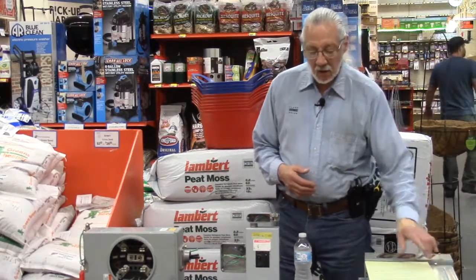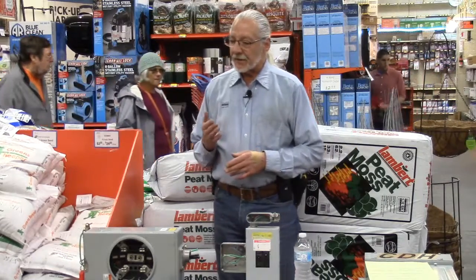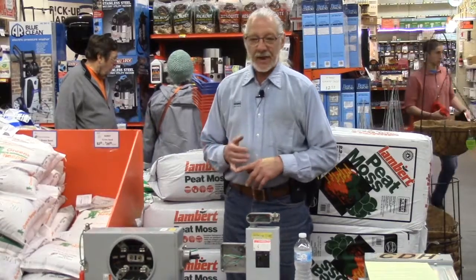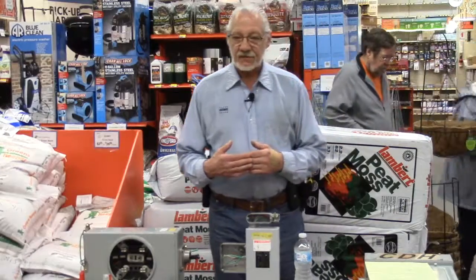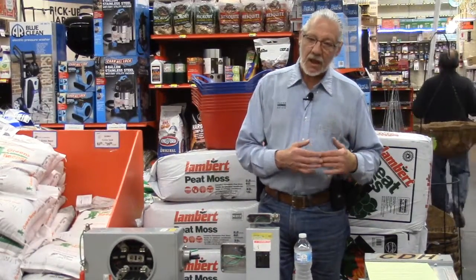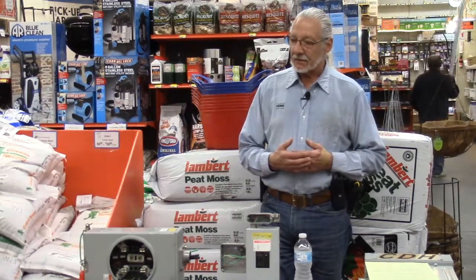So you're going to want to know the requirements of what you're doing. If you're adding a dishwasher, if you're adding a jacuzzi into a bathroom, if you're doing these kind of things, you're going to be upping the amperage of your house. And is your old service, in fact, sufficient to supply the new amperage draw that you're planning to add?